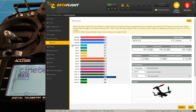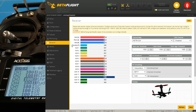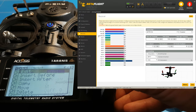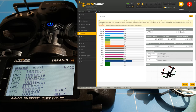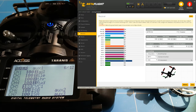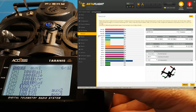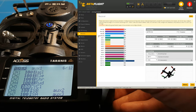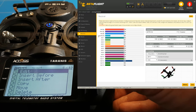To show you why both steps are needed - if I go back into the model and go to mixer and turn aux one off, then I move aux one - nothing is happening in Betaflight. So it's not only page five; you also have to go to the mixer on page six and set it again to make sure it works in Betaflight. And now it works again.